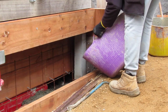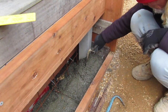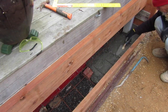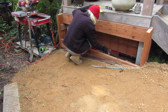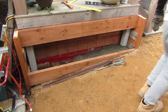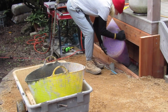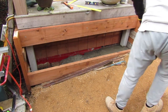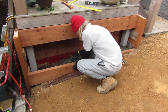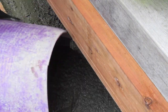After getting a couple of loads poured into our foundation, we start agitating it with our trowel to get all the air out. I'm making sure I work the concrete all through the rebar mesh so we get a really good adhesion to it. I continue to add batches of concrete, but it's always important to keep agitating in between each batch. This will stop us getting what they call rock pockets, because if concrete isn't agitated properly, it won't set correctly and won't give you the strength that you want.